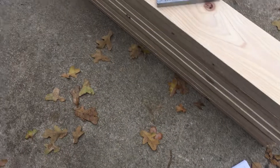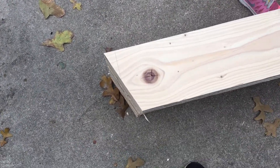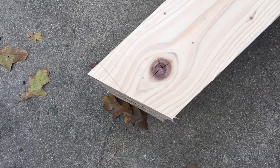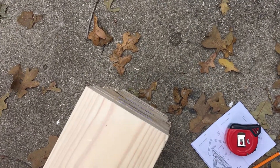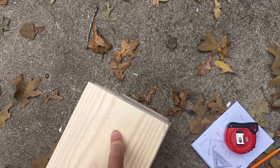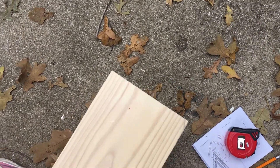We made all of our top plumb cuts for these rafters. I only had to make one cut per board and they're even — pretty happy about that on this side too, pretty straight. Just by measuring down the middle, taking half of that, and then running that 22 degree line along the center dot, we're able to get both rafters from one board.